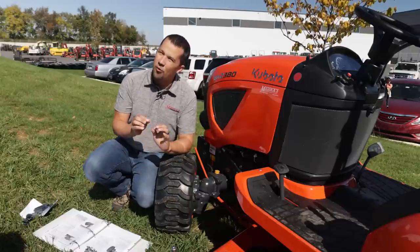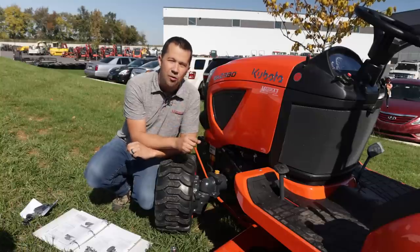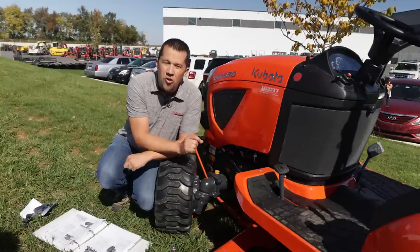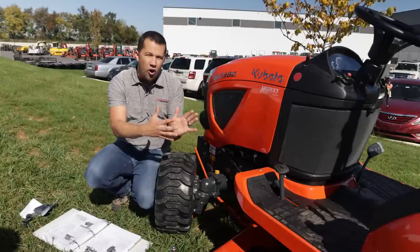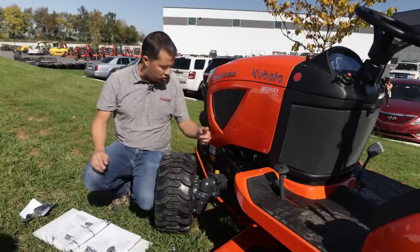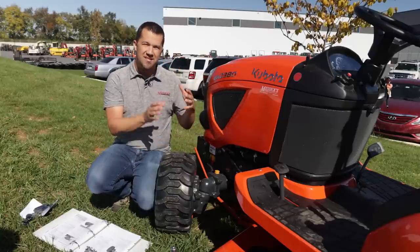The difference in these two tests is probably due to a difference in the adjustment on the steering stop. If you look at the backside of your tire, you'll notice there's a bolt back there with a jam nut on it that can be adjusted in or out to change the steering stop. Once you've turned that wheel all the way around, that bolt is going to contact the axle and stop the tire from turning further. If that bolt is adjusted too far in and you're letting your tire turn too far, there are a number of things that could be damaged - steering linkage, or in the case of a bigger tractor, the tire can actually come around and contact the side of the hood, or you could do damage to your steering cylinders. When you're at that extreme angle, you want that steering stop hitting the back of the axle housing to keep damage from occurring.